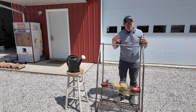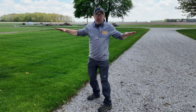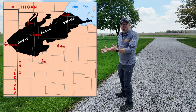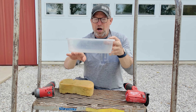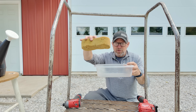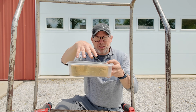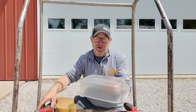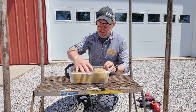There are a lot of people who haven't been exposed to some of this stuff. As you might be able to tell, it is incredibly flat where we live. This was a prehistoric lake bed — over in Ohio it was called the Black Swamp, and at one time this would have all been underwater. The ground is such that it holds water; it's got a heavy clay base. Clay has low permeability, meaning water doesn't move through it very easily. Imagine this tub represents our subsoil layer — hard clay. Everything above would be topsoil, which has higher permeability. There's 12 to 18 inches of topsoil around here depending on where you dig.